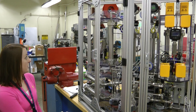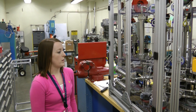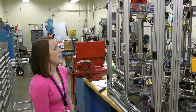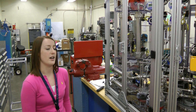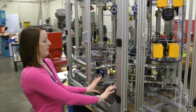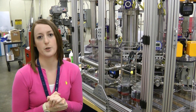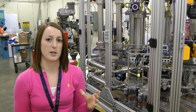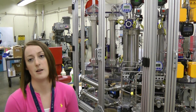You can see it here. We have it up on the table where we've been doing mechanical buildup. The water processing module is essentially just a water electrolysis system, which we can use for several different ISRU systems. Any different type of ISRU system that produces water, we can then break that water into its constituents — hydrogen gas and oxygen gas — using water electrolysis. The electrolysis stacks don't function just by themselves; they need several ancillary components to work properly. We also have to produce gases at the right purity standard for any downstream customers, so we have a whole lot of components included in the balance of the plant for this module.